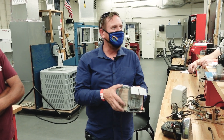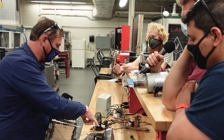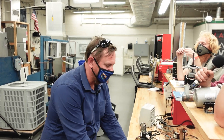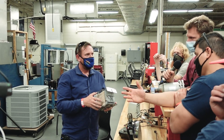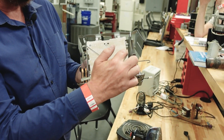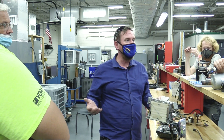It's converting electrical energy, watts, into heat energy, BTUs. So how do you convert the energy to heat? With a resistive element. Nichrome — this one's Nichrome. Nichrome is typically what we use in residential AC: Nichrome resistive wire. So as electricity flows through that Nichrome, it's getting hot. I wonder why you don't get electrocuted while you touch it. It's only on this path — this material here is actually coated in a non-conductive material, so this metal is not touching the ground. If it was touching ground, it would be grounded. Anywhere this metal, the heating elements, anywhere is touching metal, it would be grounded. This is one thing we look for for a compressor or electrical heat elements — we look to see if it's grounded.